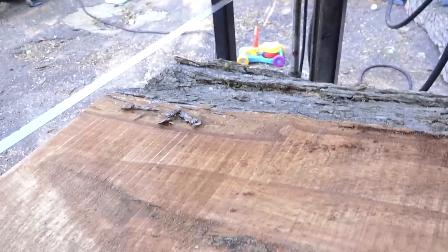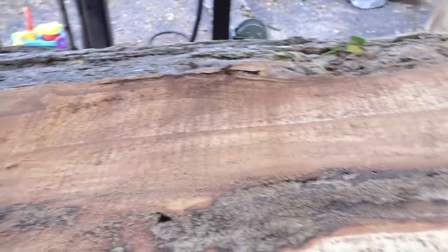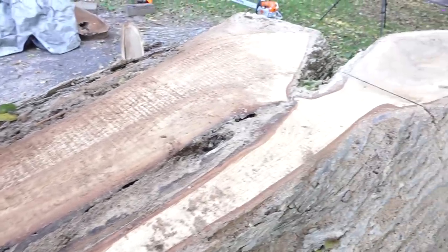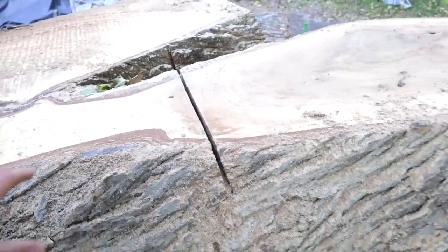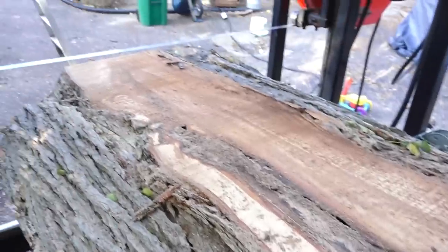these cuts. So I think for the first couple of cuts, I'm just gonna make a couple pieces that are probably 6/4, so 1.5 inches thick. That's also gonna get me through all this chainsaw cut here, so that we can make continuous length cuts that are a lot wider than this currently is.